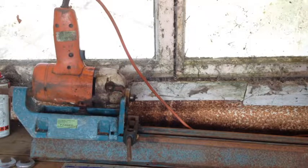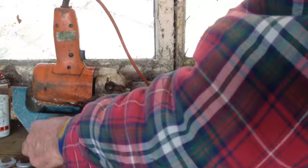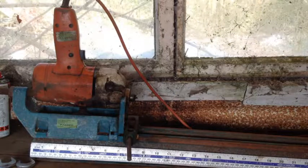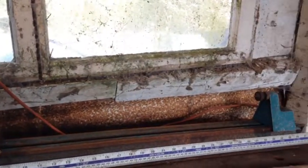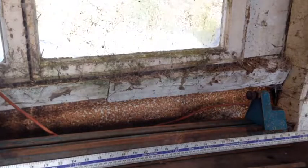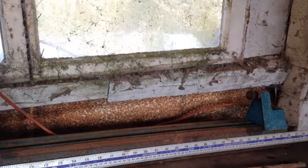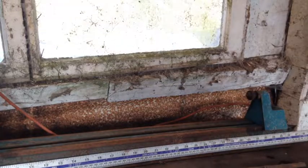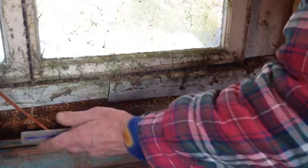The actual length of the whole bed is about three feet — good old British feet and inches, imperial. If I stand the ruler up there and pan the camera, there is the three-foot mark, just there, absolutely bang on. The actual distance between the centres — the most you can get really is about two feet, which is pretty good for a small machine like this.